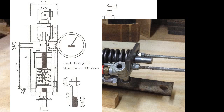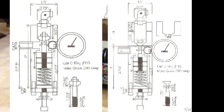I went around and figured out using a smaller little stopper in the upper part of the valve might work okay. So I did that, and in this one I cut the stopper down to a 3/8 instead of a 5/8, which made it to where it only takes about 22 pounds of pressure to open it. And at the same time, I figured I'd have to either make a new one or try to use some of the old valve.